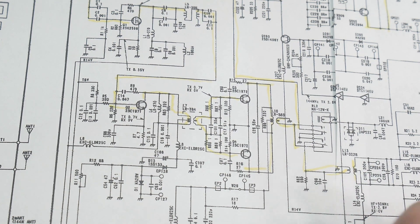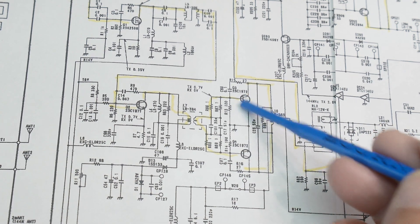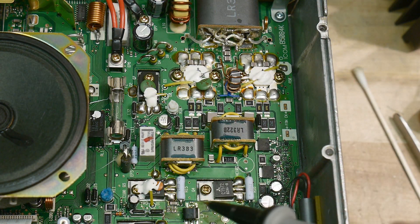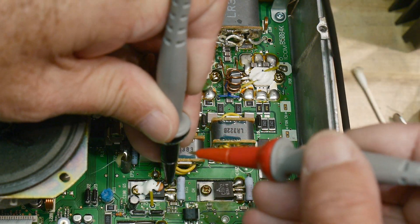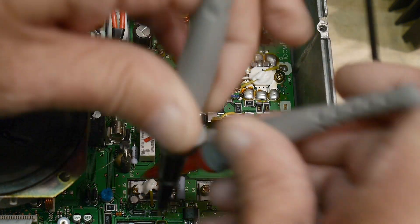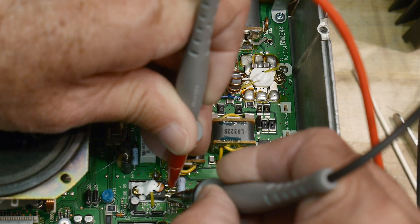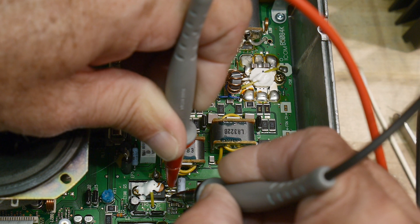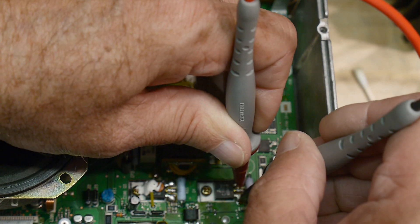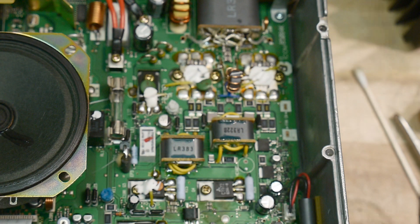So I have at least multiple things going on here. Are these transistors any good? They probably aren't. So I'm going to measure the diodes in these transistors. In circuit, it's always kind of difficult sometimes to measure things. This one looks like about half a volt. And then over to this one — half a volt. So this transistor seems okay. On this side I get half a volt and I get half a volt. Those transistors seem okay to me.